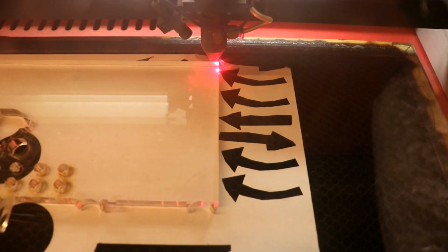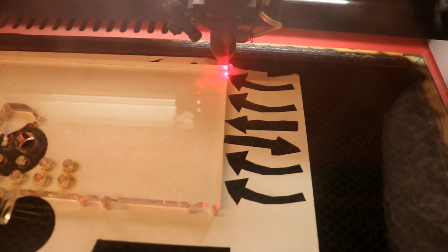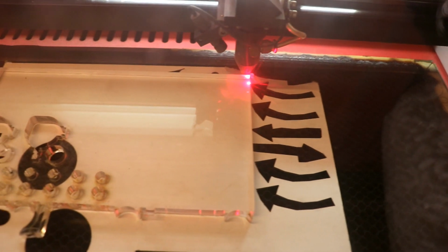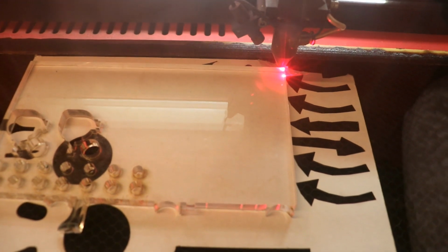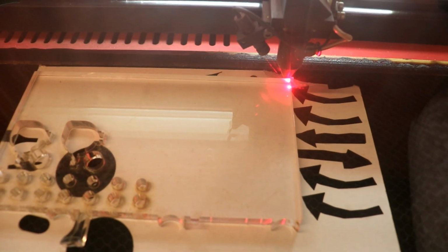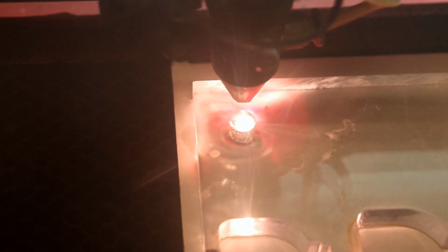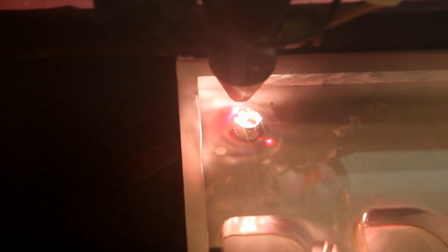I'm going to rely on the resting it on a piece of white cardboard trick, which works really well, stops it setting fire to the laser cutter hopefully, and produces a radius, as I mentioned before, on the underside of all the cuts, which is nice. I'm not going to video all of this, but just so you can see what it looks like with the card underneath.